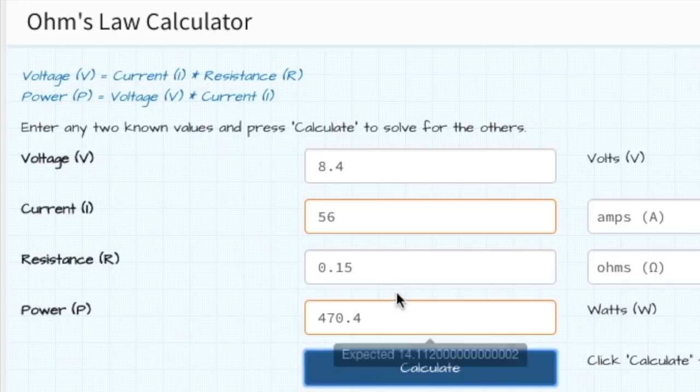If you're at 8.4 volts, you need to be at a much higher resistance — at least 0.40 ohms minimum. At 0.40 ohms you'll be at 21 amps back to your battery, which is fine for a 30-amp drain battery. At 0.30 ohms you get 28 amps, which is the minimum safe resistance for a 30-amp high-drain battery at 8.4 volts. The minimum required resistance for a 30-amp drain would be a 0.30-ohm coil to keep the return amperage within safe limits.